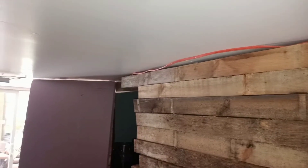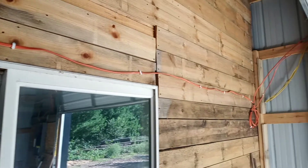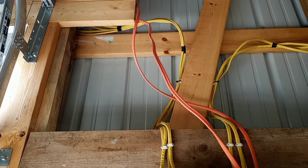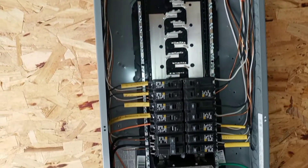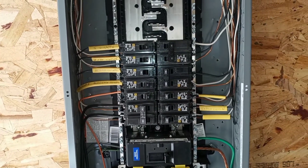This is a 7-kilowatt water heater — point of use, tankless. It takes a 240V, 30-amp circuit to run it. Here I just ran some wire outside my building. I know it's not to code, but we don't have codes where I live and it's safe enough for me. Just run it right into your breaker box — I'm not going to tell you how to do that. If you don't know how to hook up these boxes, you probably shouldn't do it.